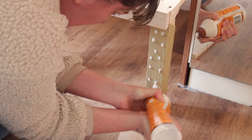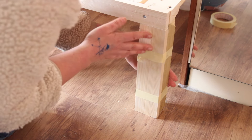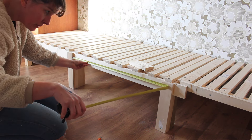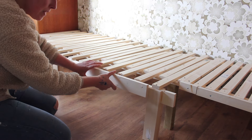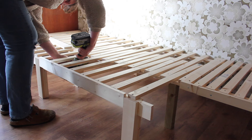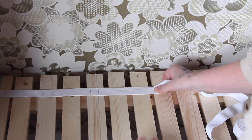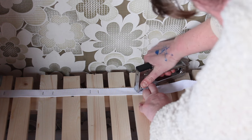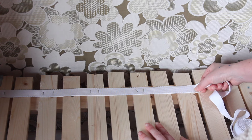Cover up the not-so-nice legs with lots of wood glue and scrap pieces of the frame timber — push them in place and wrap them with a bit of tape; this will set in a few hours. We're going to do the same for the pull-out piece. I'm going to use a piece of timber that's slightly wider so it creates a little upright for the mattresses to sit behind so they don't slide off the sofa. To keep the slats of the pull-out frame together at the back, we're going to staple on a piece of woven ribbon using a heavy-duty stapler — you only staple this on the slats that pull forward.